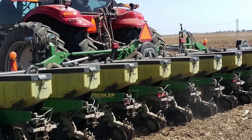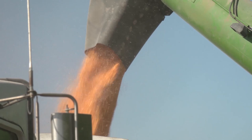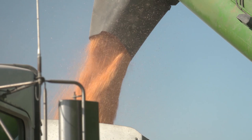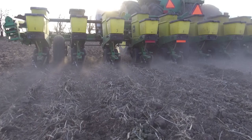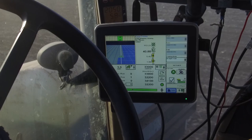There are many options available to producers when it comes to applying downforce or down pressure during the planting process. Too much or too little could cost you over the long haul. To set downforce correctly, we need clarity on what the row unit is doing. There are sensors we can mount on the row unit that tell you if there's a smooth ride and if the row unit is staying on the ground. We can also put a weigh pin on the row to tell us the amount of weight being pushed down. Typically, if a grower is applying more than 450 pounds of pressure on that row, it will cause compaction. Between the sensor and the weigh pin, we can determine if we're providing enough or too little pressure when planting.